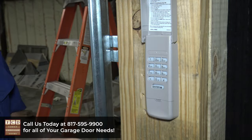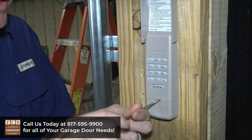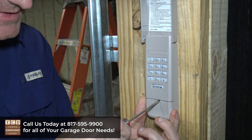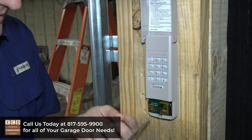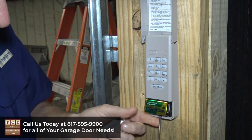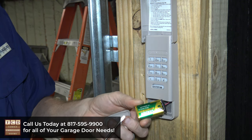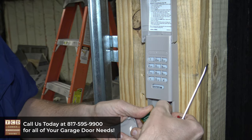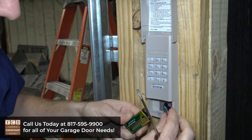What we're going to do is open up the cover, and you'll see down here there's another little cover that you can take your flathead screwdriver and just twist it until you hear it pop, and it'll open up that little piece there. Then you can take it, pry that battery out — this is usually going to be a nine volt battery. Just take those leads off.